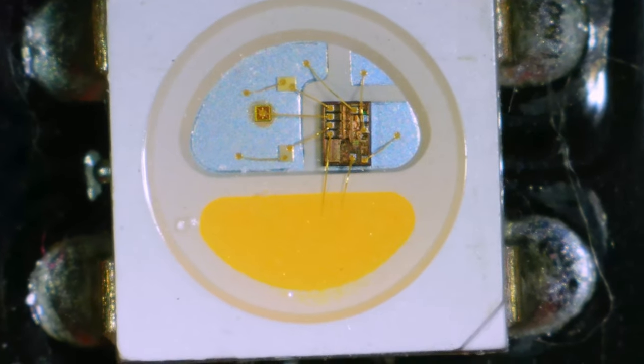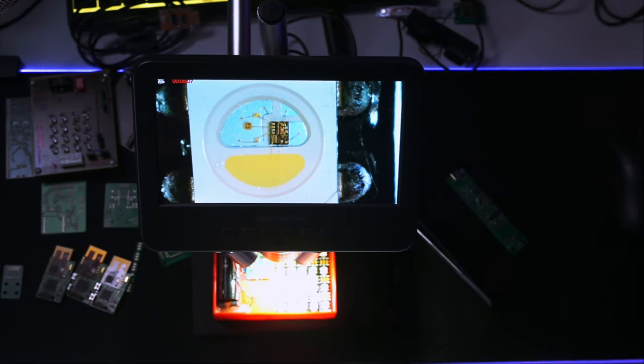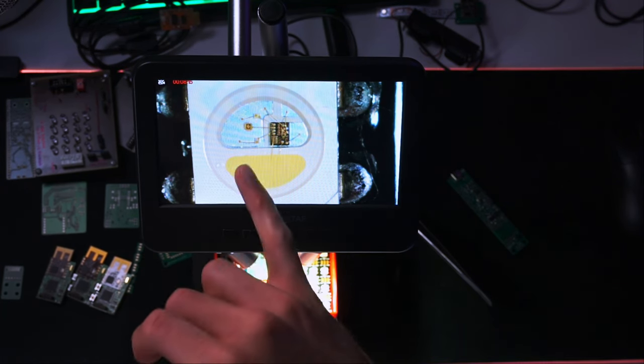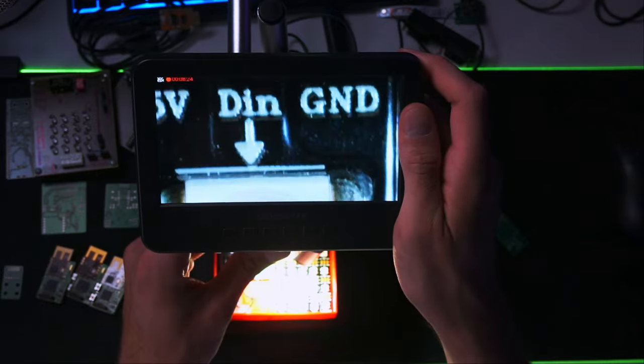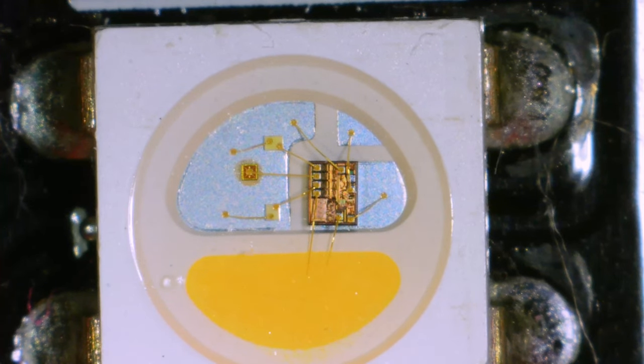What's also very interesting is going to the LED light strip and seeing how those integrated LEDs actually look. You can see there's a chip in the middle of the LED — a black one — with gold wires connected to the outside pins, which are this silvery plate. The ground one is the big one on the side. Those three things are the RGB colors, and the extra light-producing component is the white LED. So this is an RGBW integrated LED component.